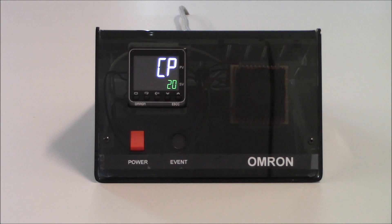With a control period of 20 seconds, if the unit in PID control is calling for 50% power, I will keep my output on for 10 seconds and off for 10 seconds. If my power demand increases to 75%, then my output would be on for 15 seconds and off for 5. It's a time base for slicing your power for a pulsed output. Since I have a relay output, I'm going to keep it at about 20 for now.